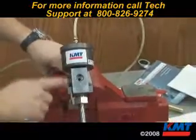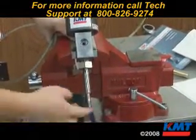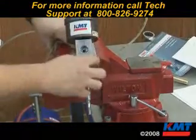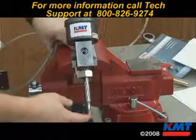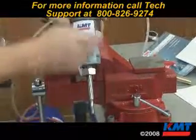After we get it all rebuilt, we'll put it back on the machine. If any water is dripping out the end of the stem, then you know that needle and seat is not in position. It's got damaged in there. So we don't want any water dripping out there when the valve is in the off position with high pressure going into there.